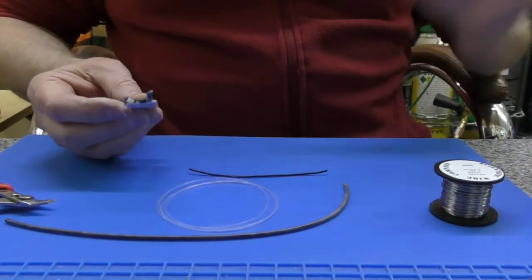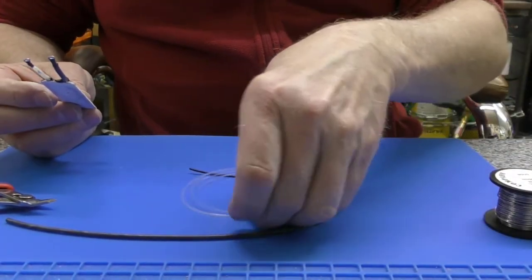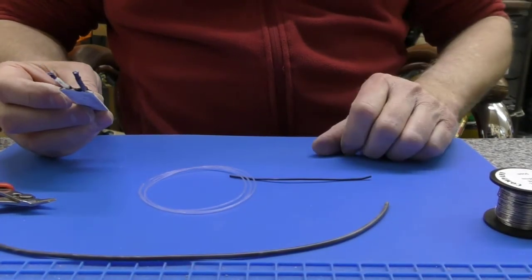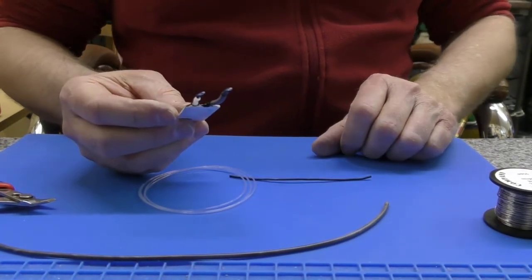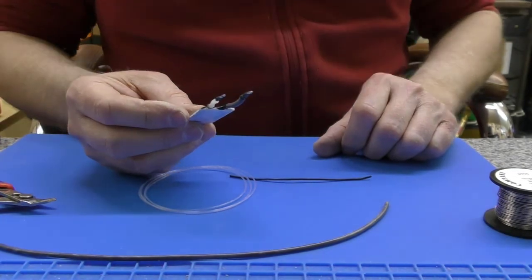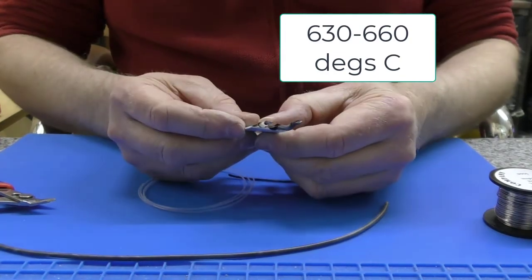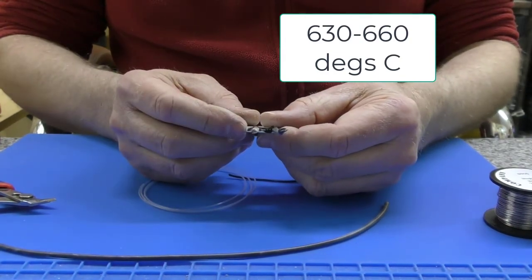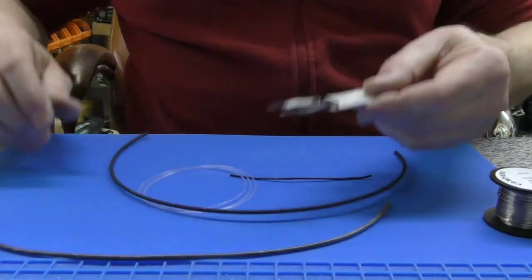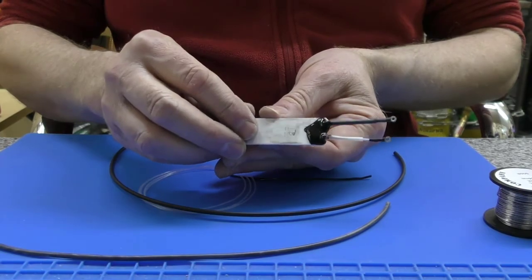So yeah, nickel wire, copper multi-strand, 24 gauge, silicone tube, thicker silicone there, and silver solder, 55% silver I think it was. Can't remember what the temperatures are. I think I've already mentioned that, but I'm sure that is what's being done with these originally, although automated. Anyway, enough waffle. There we go. Hope that helps if anyone ever gets around to doing this.